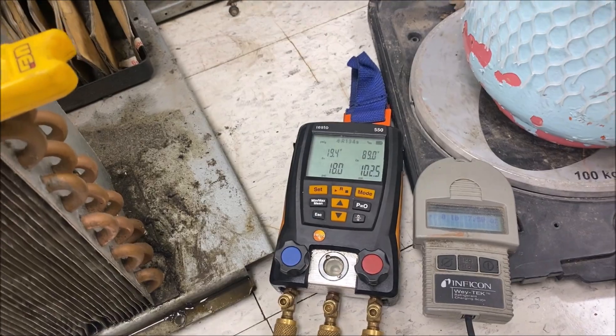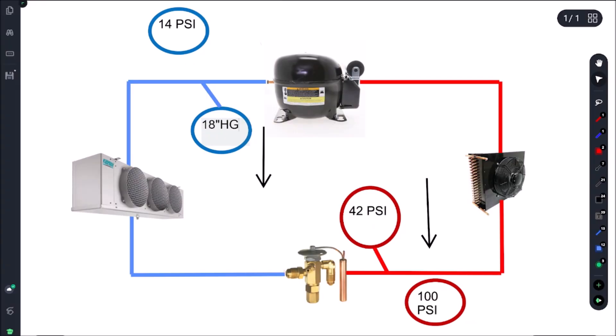We're at 89°F - right there on the border. We ended up with 17 psi on the low side and 102 psi on the high side. Pressures are slightly high - I probably overcharged it a tiny bit - but the whole point of that exercise was to determine if we're low on charge or have a restriction. This confirms for sure that we are low on charge. Now we're going to do a leak test and go from there.